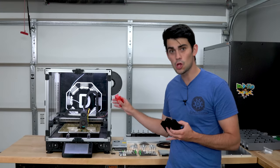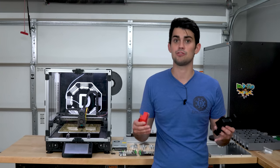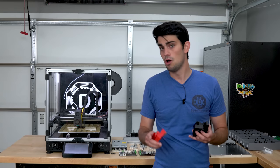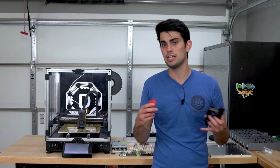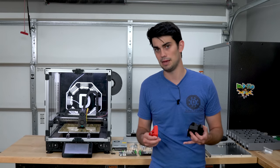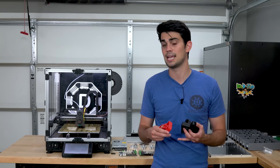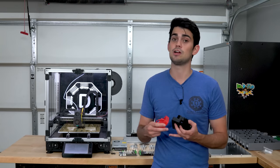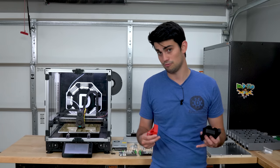Voron is an enclosed printer which means it will trap the heat of the bed, creating a chamber that can reach upwards of 60 C, which is ideal when printing ABS, nylon, polycarbonate, and really any other filament that is not PLA-based. The heated chamber decreases the temperature gradient between the plastic that has been printed and is currently being printed, reducing shrinkage, residual stresses, and part deformation.